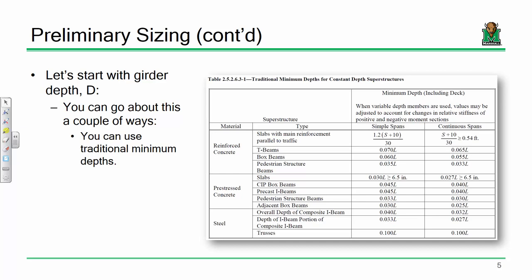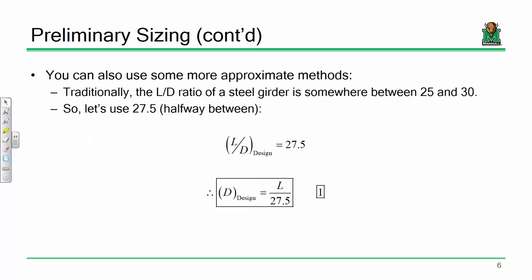So I want to start off with the girder depth, D. By girder depth, I'm basically saying how deep the web is. You can go about this a couple of ways. You can use traditional minimum depths. There's actually a table in the specification that will tell you,